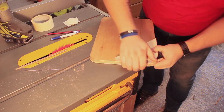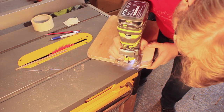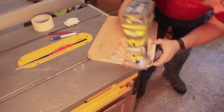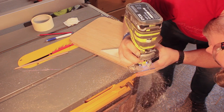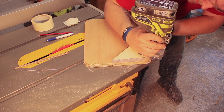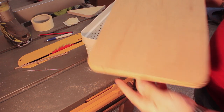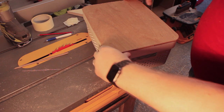With a functional template in hand, I used a Trend template profiler that I got off Amazon in order to follow the guide around, because I didn't have any flush trim bits. I went around the top lip of every single box as you see here, and then flipped it over and went around that little rebate in the bottom for the lip. It actually seemed to work on the first one — unfortunately I've now just got to duplicate it five more times.